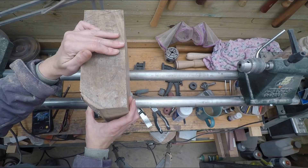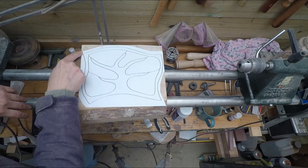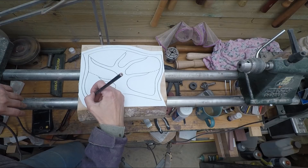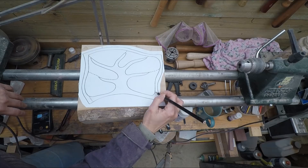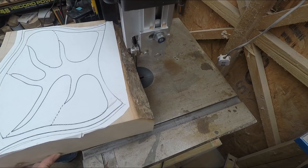I may well need to put a back onto this, which I'll slice off another piece of that, but I haven't got that prepared today. I'm just going to go ahead and get the outer shape of this box cut out, cut the outer box first of all just following the outer line, and then come back and cut the inner box out.